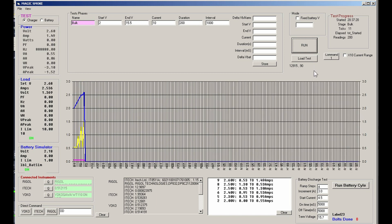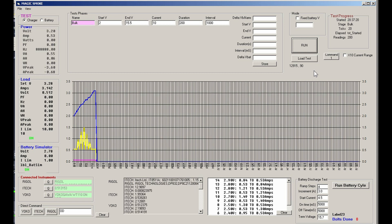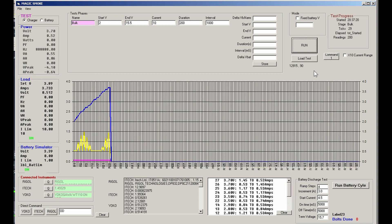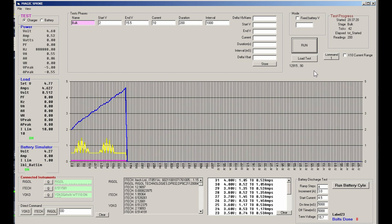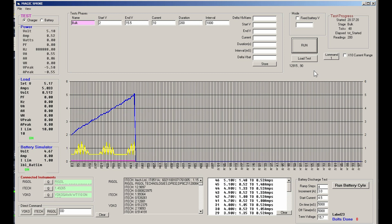So we're at higher temperature — are we looking for a lower or higher termination voltage? I think I know: it's specified at about 20 millivolts per degree Celsius, which suggests it's a positive temperature coefficient, so temperature rises, battery voltage rises. We've gone up 18 degrees, so 18 times 20 is 360 millivolts — this should terminate about 360 millivolts later at each stage than it did earlier, if we're right about that thermistor. If we're wrong, of course, it won't make any difference at all.